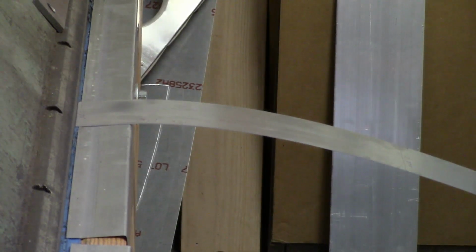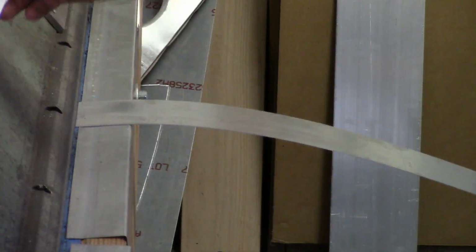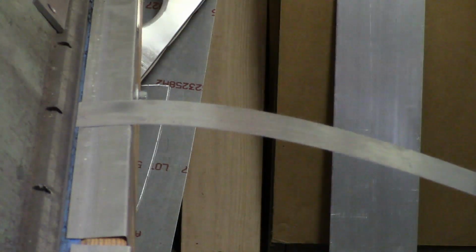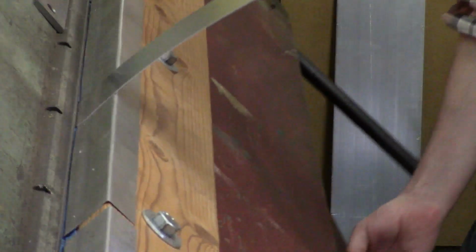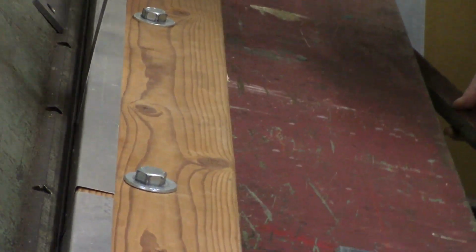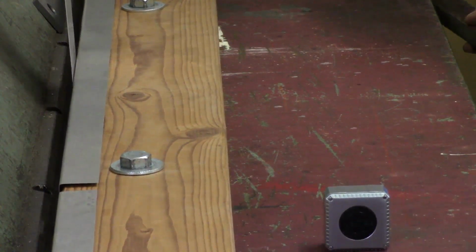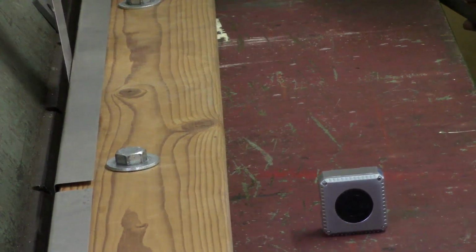We're set up for our second bend now. Target is 90 degrees. I'm looking for the protractor to show 68 degrees. Let me double check here. Yeah, 90 degrees, 68 degrees. So do a calibrate, and we'll go ahead and start the bend. And of course, this is 68 degrees getting past 90 on the protractor.